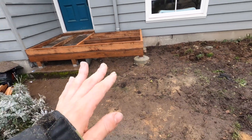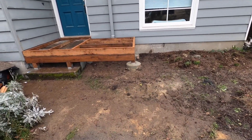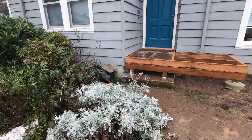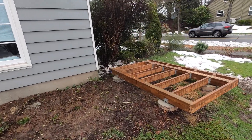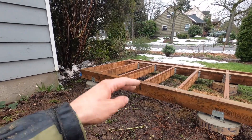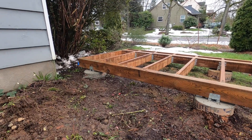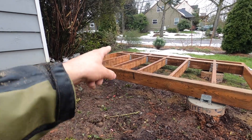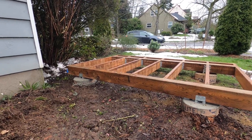It's going to terminate right where this one starts, and that's kind of why I've got to pour some concrete in here to give it a good place to land. I also got to pour concrete right where this bush is to create a landing for these stairs. The first thing I did was complete this pad. There are a couple unique things about this. Usually you'd put a beam and then frame on top of that, but what I decided to do was inset all of the frame, because otherwise the footings would have been below grade — especially up in that top corner — and you don't want your beams just sitting getting wet. So this was kind of the only option.